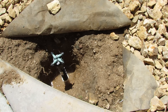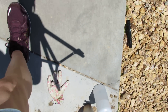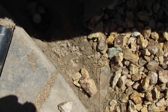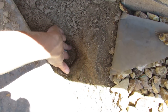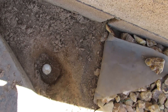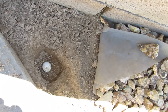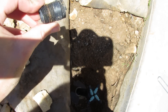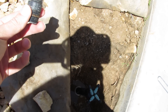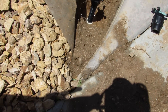Not all of the sprinklers in this area did I want to turn into a drip system — some I just wanted to cap off, which I've done over here. I dug up the sprinkler head and twisted on a little PVC cap — I believe that's half inch — and it twisted right onto the little black piece. If you're capping, you probably want to leave that piece in, because that's what the cap secures to. It's male-to-male going in, and the irrigation piping is a female opening deep down inside. I hope you found that helpful — be sure to check out my other videos for more do-it-yourself.